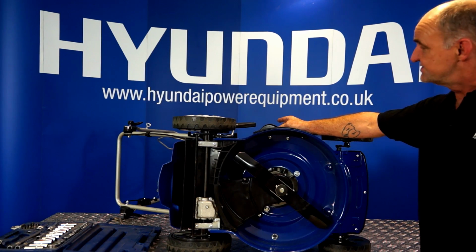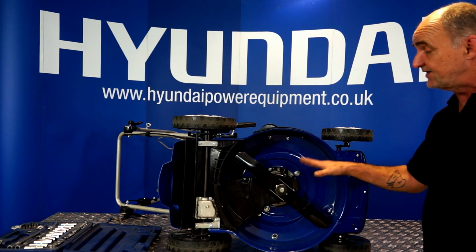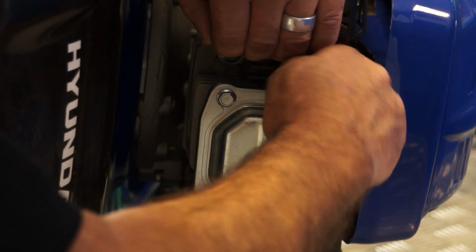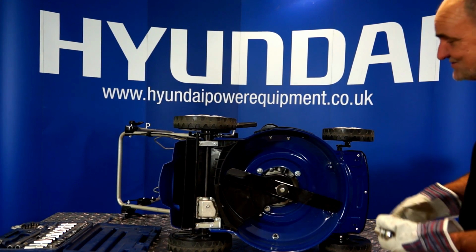If for whatever reason something's pushed the lever on the handle and I haven't noticed it, when I rotate this I could inadvertently start the engine. So what I'm going to do is pull the spark plug off. So now no matter what I do with this, there's no way the engine's going to start without a spark. So again, another health and safety tip.